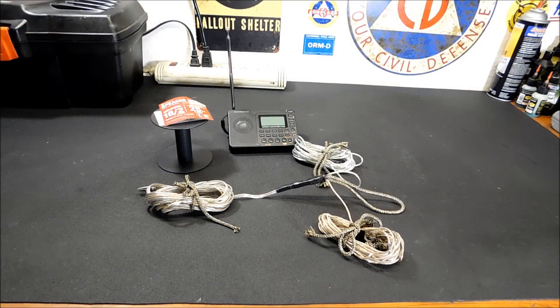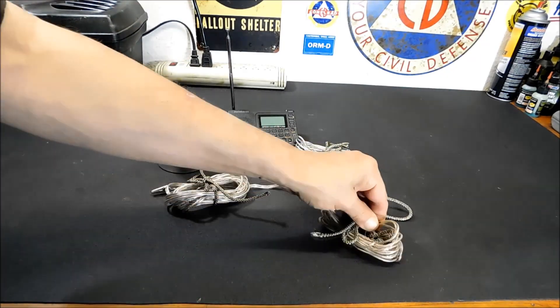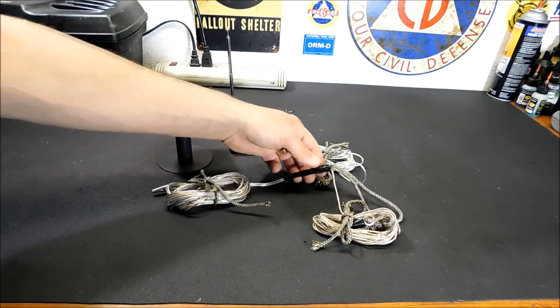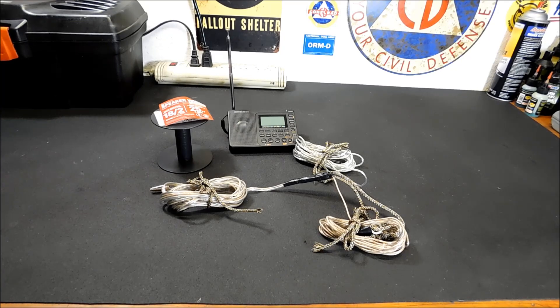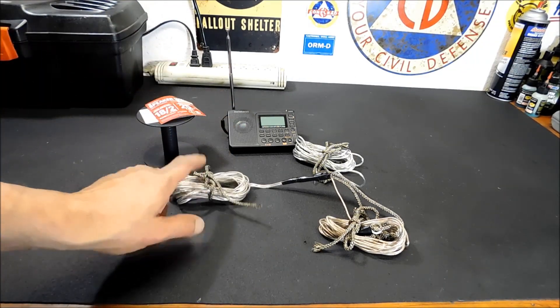We're back inside — I rolled it back up with the two ends separate this time, which makes it a little easier to deploy next time. That is the antenna. It's very simple — there's no soldering required. I did solder the clip myself, but you don't have to. This is all just friction fit — stick the wire in, clamp it down, good to go. Same with the end pieces. I didn't even strip the wire — just doubled it up, stuck it in the hole, clamped down with pliers, and wrapped it in electrical tape to keep it neat. You don't need a radio degree or an amateur radio license. I would not recommend transmitting with this — it's not the correct antenna for that. Speaker wire, six bucks, 25 feet, clear stranded, nothing fancy — got it at Home Depot. When you're carrying a tiny radio, this really does boost performance a whole lot.